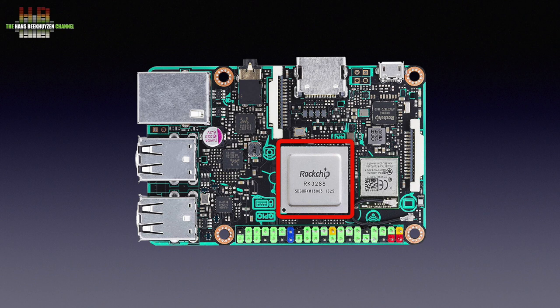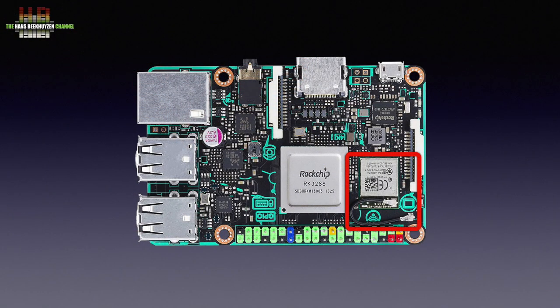The ARM processor can easily clock down when full speed is not needed, reducing noise. The faster graphics processor is of no consequence unless the GPU is used for DSP functions. The 2 GB dual-channel DDR3 memory is twice that of the Pi and faster. The gigabit ethernet port has its own controller, whereas the Pi uses the USB 2 controller, limiting it to 100 megabit. The WiFi BGN radio has an IPEX connector for an external antenna, which keeps WiFi signals away from the audio electronics given the metal housing.